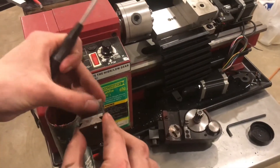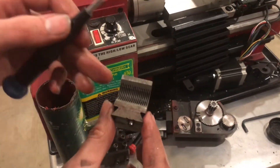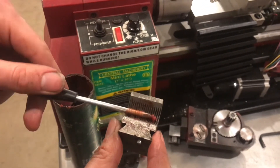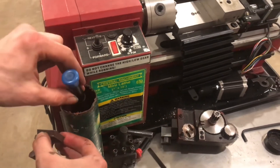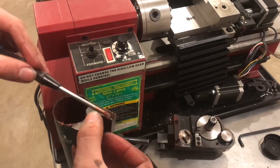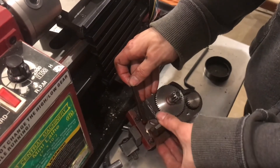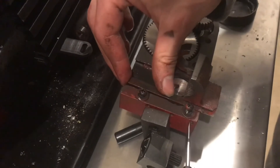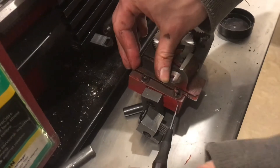This half nut is clean — I can actually see those half threads now. They're ready to be re-greased. I don't want to forget to also grease the dovetails here; that will just make operating the lever feel smoother. So I can get half the dovetail in, and I need to find that pin.